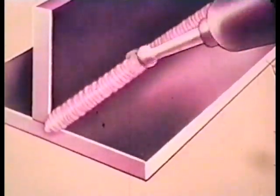The use of peening is the application of a balancing force to prevent distortion. By peening the bead, we actually stretch the weld metal, counteracting its tendency to shrink as it cools. When we use peening, Shrink really takes a beating. Peening takes the fight right out of it. But don't overdo it — too much peening may damage the weld metal.